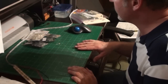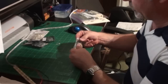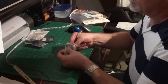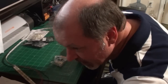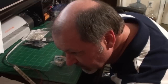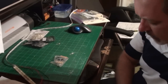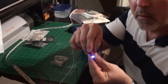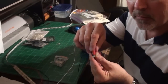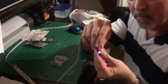I know this video is running too long, I have a couple more things I want to talk about real fast. First thing: RGB flashers. I recently found a new type of RGB on the market. I'm getting out an RGB flasher — this is the one I'm used to. Setting the power supply to 2.6 volts — RGB flashers are around 2.6 volts. Set the voltage too low and you won't have all the colors flashing. You can see the pattern going through it — it does a fast flash dance and then goes to a slow one.